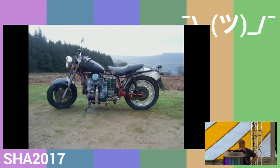As I said, I've made some other diesel bikes. So to briefly say, there's this, which is again built on a BMW frame with the standard gearbox and transmission. I had to chop and lengthen the frame for this one. And then when you paint it up nicely, the MOT man can't see that, so he thinks it's standard. And this is using, I can't pronounce the name, so I won't try, an East German V-twin air-cooled diesel engine. It's 800cc. It weighed about 120 kilos all by itself.